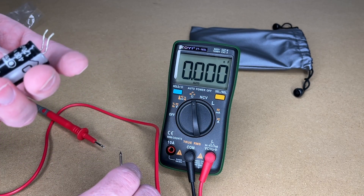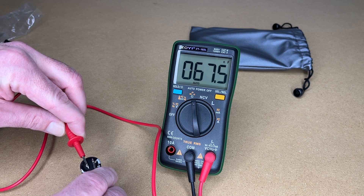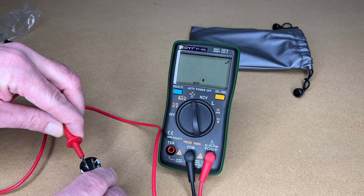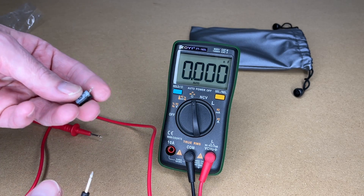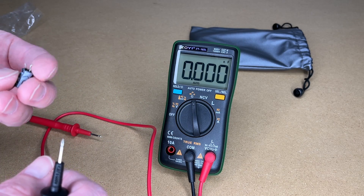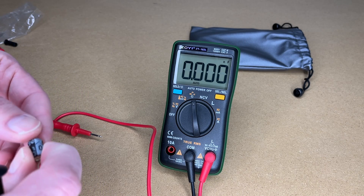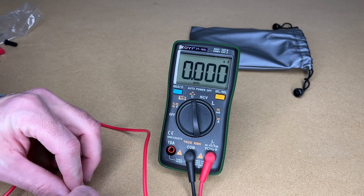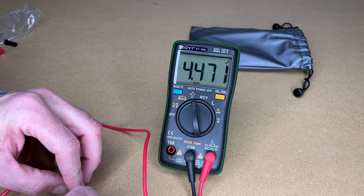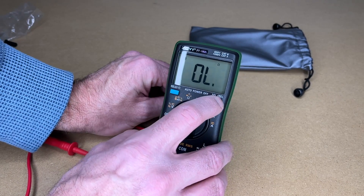Here's a larger one rated 120µF — I'm getting 106µF. There will be different tolerances, and these are older used capacitors, so you won't always get the exact marked value. This one is rated 4.7µF — let's try it. I got 4.47µF, which is pretty close.